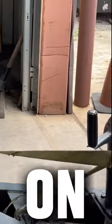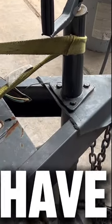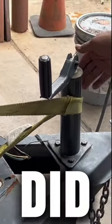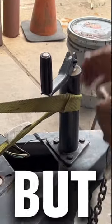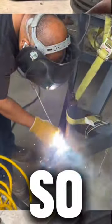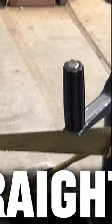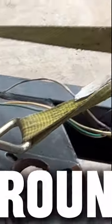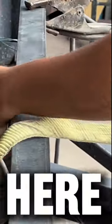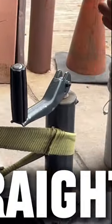We have a jack on this trailer that was bent. We have weight on it right now, but it was leaning on us. We want to get a weld around here, but we need it straight first. So I got it hooked here, hooked here on something solid, wrapped it around high so we could get it pulled back, and then hooked on this angle iron here and tightened down.